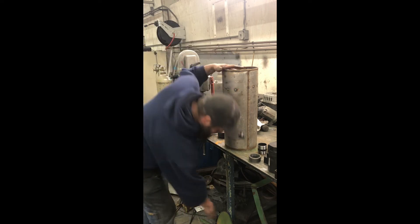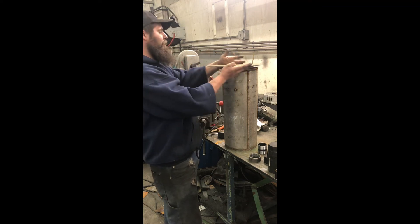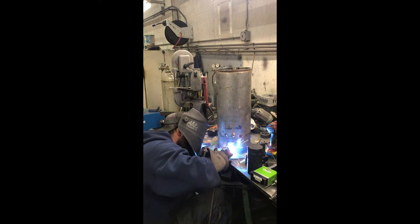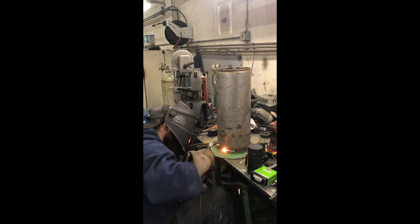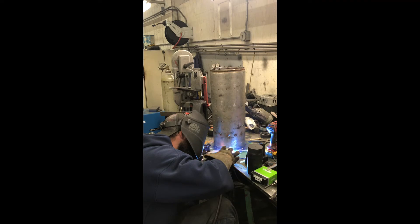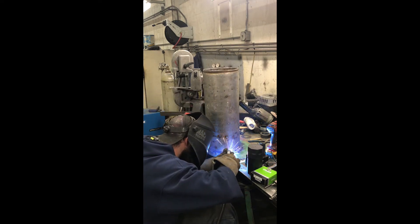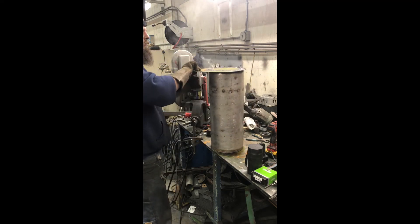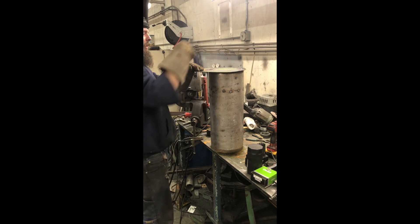To get any further, I need to put a floor on here. I've got a piece of that 14-gauge that we cut out of the heat exchanger standoff. I'm going to get this cleaned up, weld it down on there, cut this in half, get this guy on there, and then we'll get it tested. Now we can go through and just trim off the excess, grind it down nice and flush, cut our fitting, and be ready to weld it on.